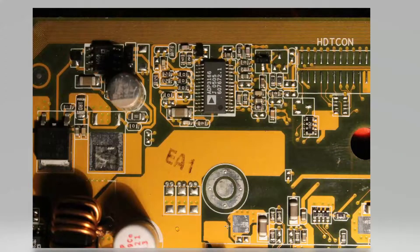So we're starting with VCore. Your pin would be 1, 2, 3, 4, 5, 6, 7 — this one right here. You can also grab it from here and here. Now this is just a usual feedback pin mod, so from there you want your variable resistor to ground. For values I would recommend something in the 200 to 500 kilohm range here for this variable resistor, since this is a pretty high impedance sort of deal.